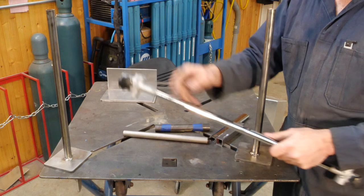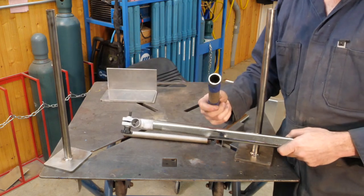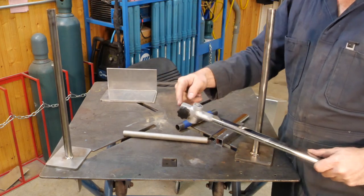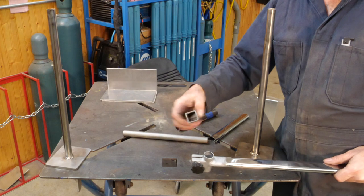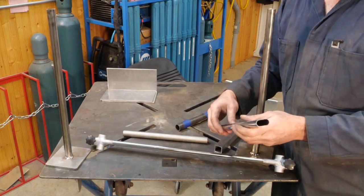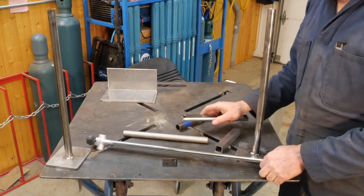This here is a welded up thing. These tubes on the end is the 1 inch 0.065 wall tube that of course telescopes on this. I welded up some bosses to it, and this is just made out of the very common 1 inch square tube. And this section in the center, this chrome plated section that's shiny, is a leftover scrap piece of this oval European closet rod that I needed for a closet project recently.